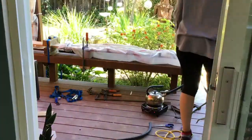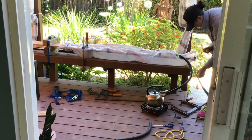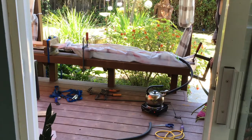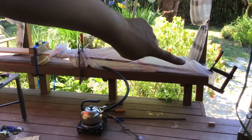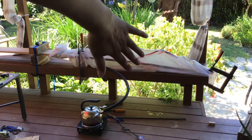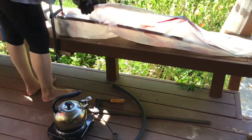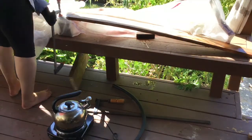I got my kettle and went to the auto parts store and got a piece of radiator hose, about four feet. The only cost was for the radiator hose — it worked great. I haven't built a steam box, but if you want to steam bend something while forming it at the same time, give this a try. I started with the hose on the right side, then moved it to the left to make sure the heat was coming up from underneath, which helped quite a bit. The board steamed for about two hours total.